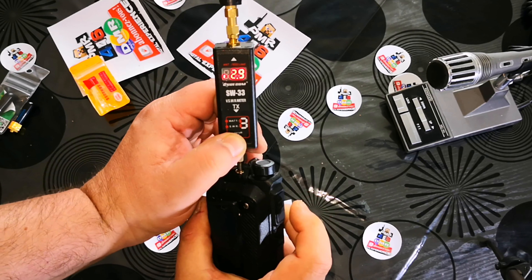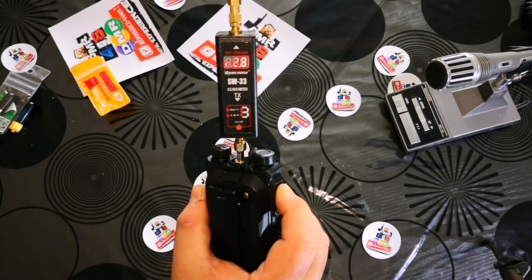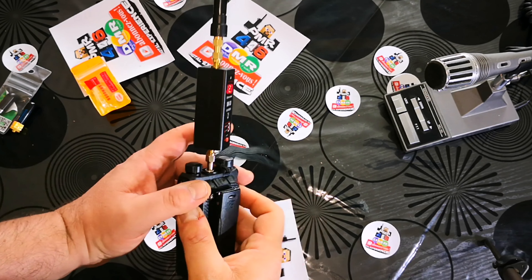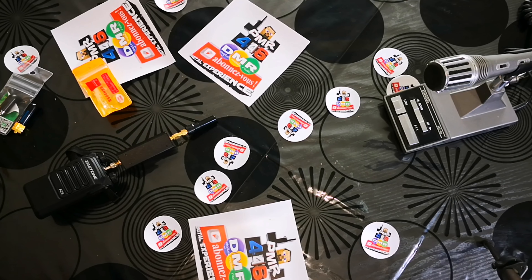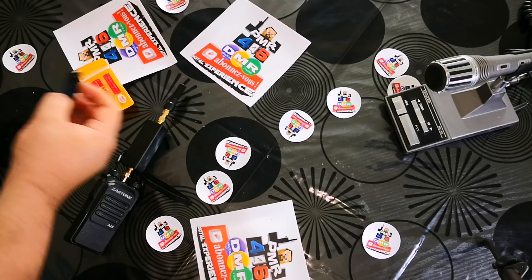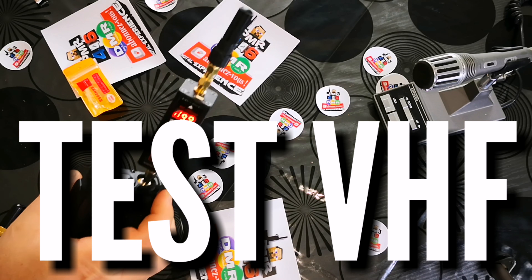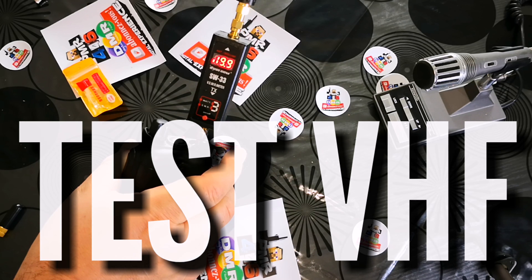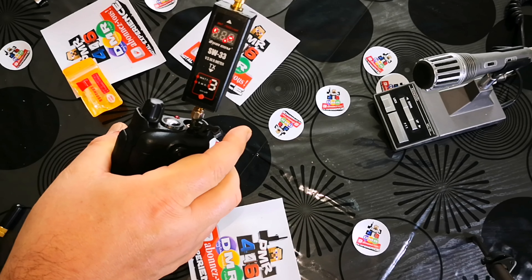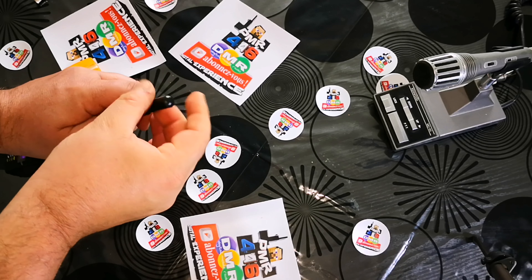So we're in SWR mode. It moves a little better. It gives me a bit more SWR with this antenna. At full power: 8 watts and some. In low power: 2.7, with 2.6, and 4.4 watts. At high power, though, it handles it poorly. TOS 2.8 currently. At full power — confirmed: 8.6 watts.